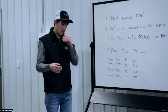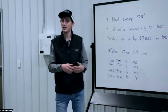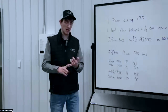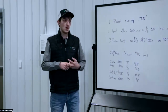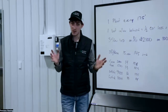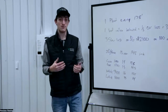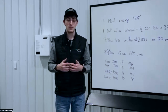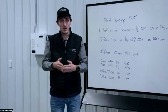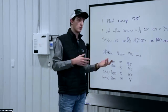When replacing blades, there are different thicknesses: 3mm, 3.5mm, and 4mm. When the parts guy says 'heavy duty disc openers,' ask how thick they actually are. A 4mm disc can actually dull out quicker — if you're in heavy no-till ground, you need that edge sharp to penetrate and get to depth. So be careful about heavy-duty discs and decide based on your conditions.